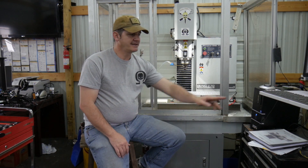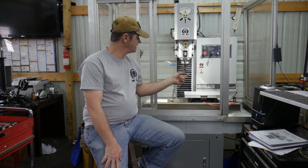It's actually a pretty plug-and-play kit — just bolting up steppers, running some wires, pulling some old wires. Once you get it run into your cabinet box, it's as simple as plugging in the proper axis to the proper drive. I worked up another Path Pilot interface so you can run it faster. These steppers have more torque than the stock Tormach steppers. The torque curve drops off faster as speed increases, but you get good rapids — I've gotten 360 inches per minute in rapid, and tested up to 200 inches per minute cutting.